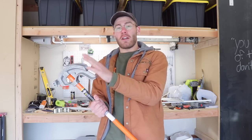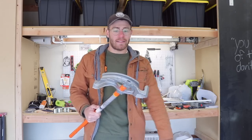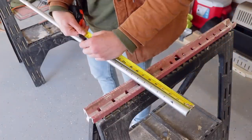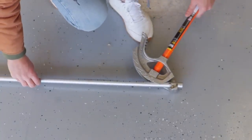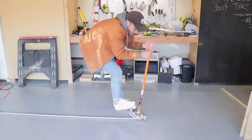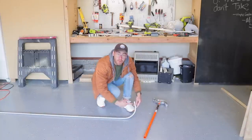I thought I could add a little bit of heat to help it bend easier, but it just crinkled and folded under the pressure of the tool. Thankfully as a fallback I had picked up some three-quarter inch electrical conduit, so we're gonna try that. Before bending anything I made a mark every inch along the conduit so I knew where to start my bend — this time at two inches — as well as how it would affect the conduit overall.